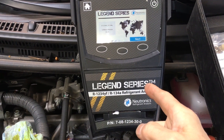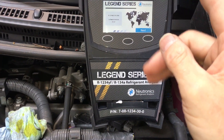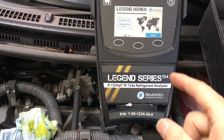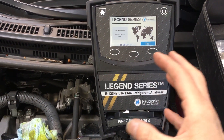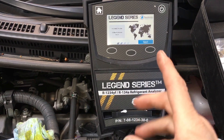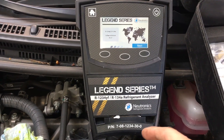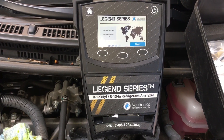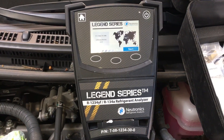Today I decided it should be a good time to go over a recovery from step one — not the full recovery, just refrigerant identification. It's one of the most overlooked and neglected parts of both automotive air conditioning and commercial or residential HVAC. You would not believe how many times there's contaminated refrigerant. I've made a couple of videos about that, especially on R22 where somebody drops a blend right on top of it.